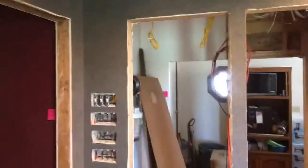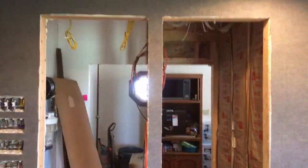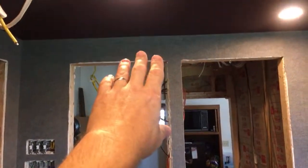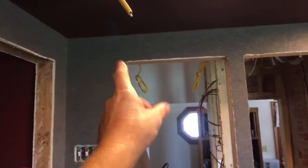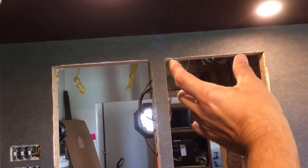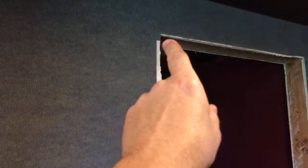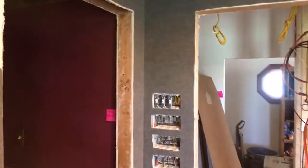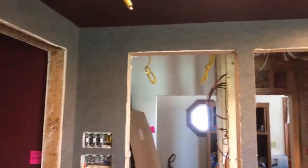I took all these little pieces: this carpet came four foot eight inches wide, so instead of working from this corner and having all this empty space with just nine inches of glue holding the piece up, I put a seam right there. The piece above the door was one piece, this strip is one piece, this is one piece, and then I started a full run that direction — same thing on this side — just to make it all a little easier.